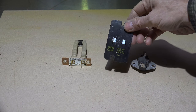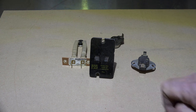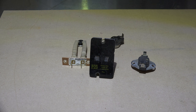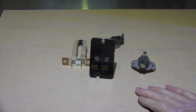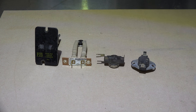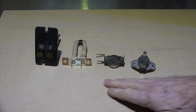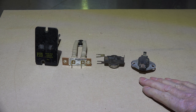The factories do not want you to place your own type of limit into these furnaces. If you took this one and the limit kept kicking off, and you went and found one rated at 250 degrees and put that in — it stops kicking off, but you're going to burn up the furnace too. If the factory catches you doing that, they will not warranty it and you are the liable one.